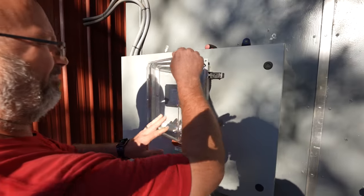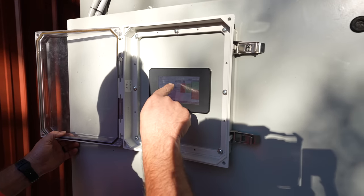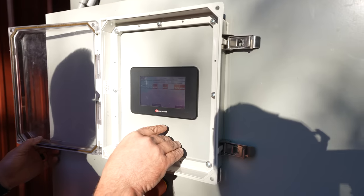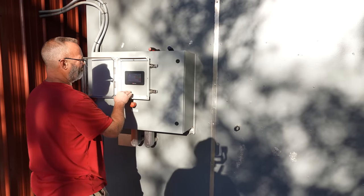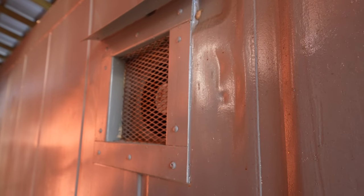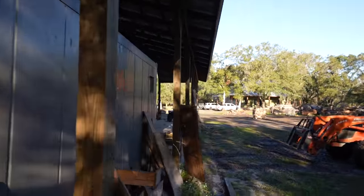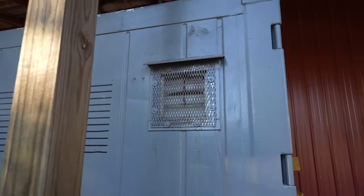Dad's going to go in to the unit and change it to hybrid mode. On hybrid mode our settings are 125 dry bulb and 75 wet bulb — so it's going to take the heat inside the kiln up to 125 degrees Fahrenheit, and anything over 75 wet bulb it will open the vents on the side of the kiln and pump the moisture outside through the vents. Here's one of the vents on the back of the kiln — that one is controlled electronically, so when it reaches over 75 wet bulb this vent opens up and pumps all the moisture out. The vent on the front of the kiln is not electronic — it's a manual vent that opens itself up a little bit and pumps out some moisture.